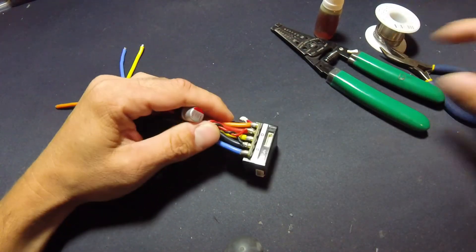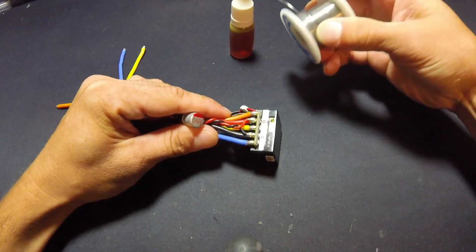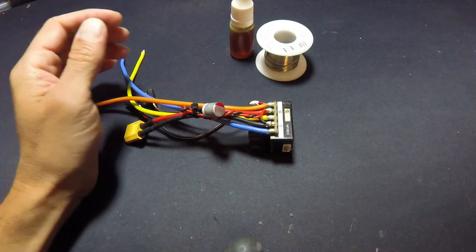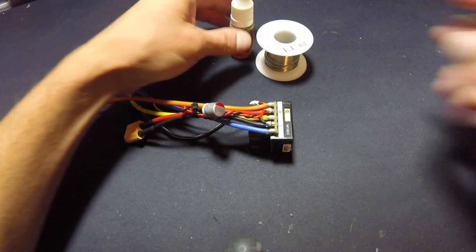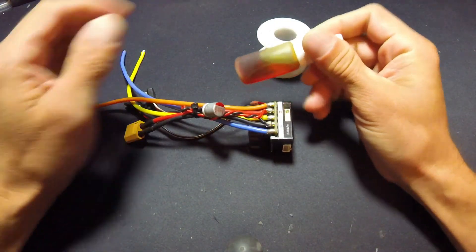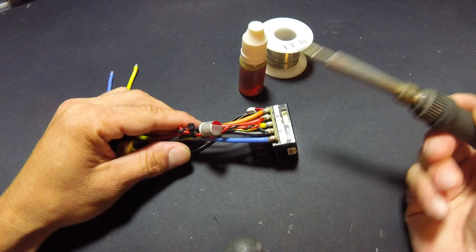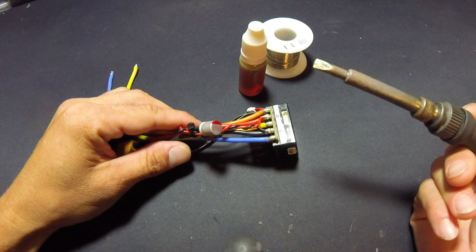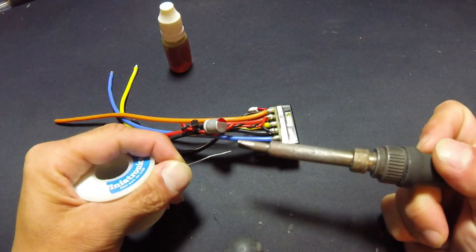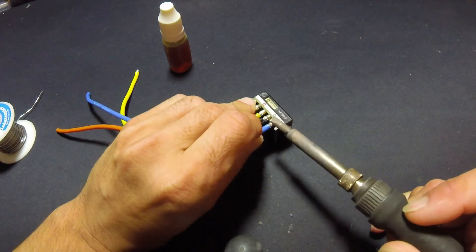Let's get started. First thing: I've got pliers, wire strippers, some solder flux, and some good old-fashioned leaded solder. It helps break up the lead-free solder that's super high temperature. If you don't have leaded solder, flux does wonders — it helps everything flow a little bit. And of course a very hot iron — this is a Hakko iron station. The meter says it's set to about 800 degrees.